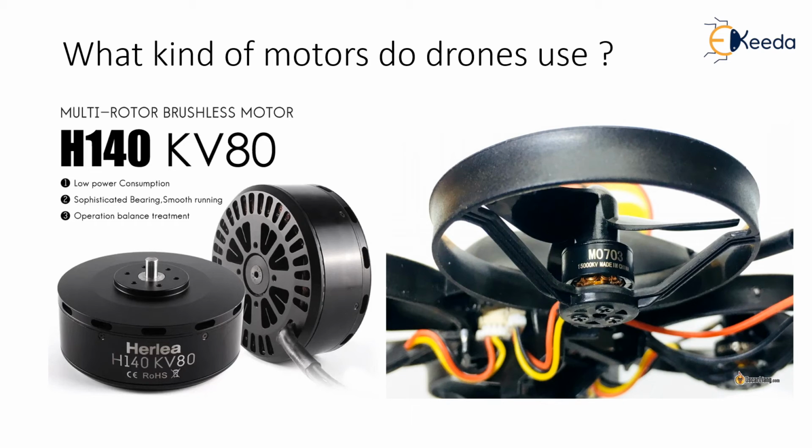High torque is required for quadcopters since you balance by changing the revolutions of the motor. The higher your torque, the faster you can change the speed of your propellers. High torque also means you don't need a gearbox and saves a lot of mass. Outrunners are not very practical for brushed commutation, as it would require lots of wires and additional contacts. Hence, most of the outrunners are brushless.